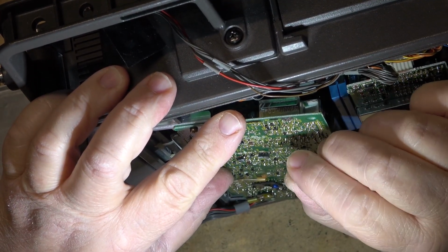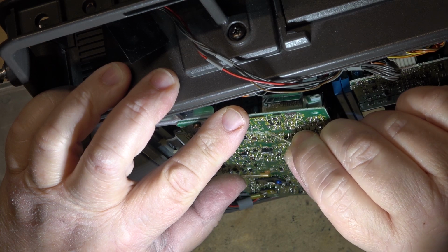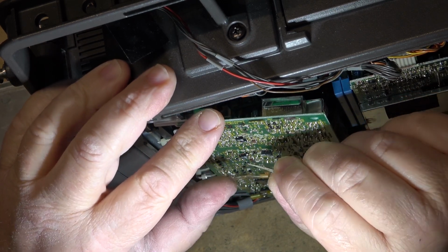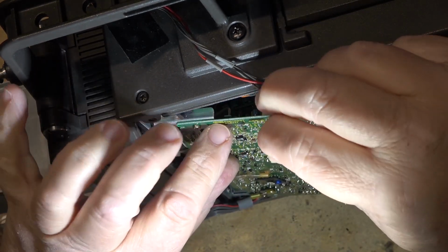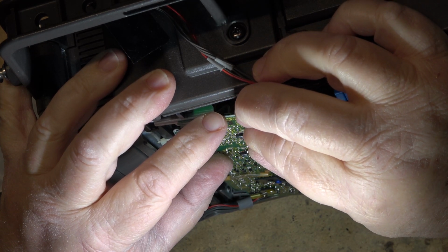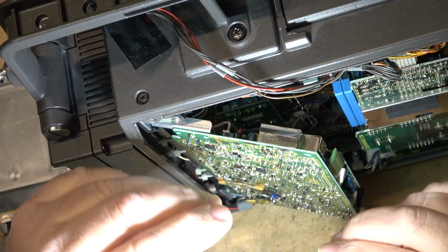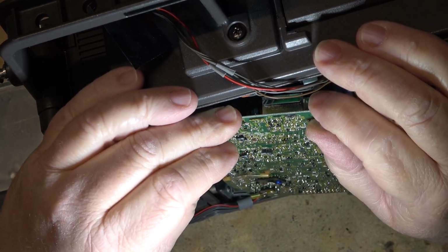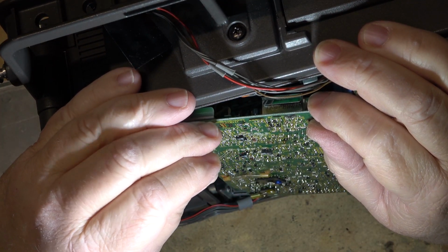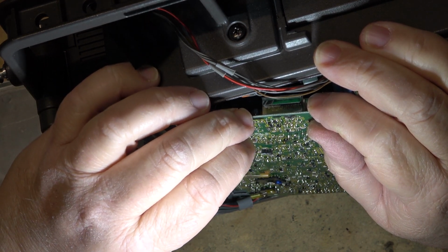it's all of a sudden gotten to be a much more complex problem than, oh, it's just got no sound. We've got no sound, we've got no linear audio, and we've got no color. Certainly in this area I can hear clicking and popping when I bridge some caps in this area here, so somewhere in here is where the fault is for the sound, for the linear audio.